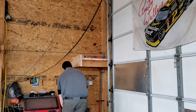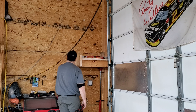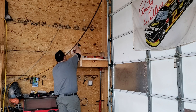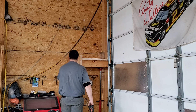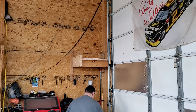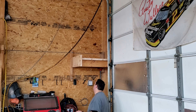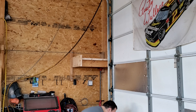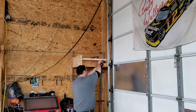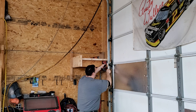Here I'm installing the vertical board that's going to support the back part of the shelf. I'm using a piece of two by four that's 24 inches long so it will reach the horizontal purlins in the wall. I'm drilling through it width-wise and running four-inch structural lag bolts through it, then lagging it to the shelf itself. I use the same four-inch structural lags to lag it to the vertical posts running in the corner next to the door and in the back corner.